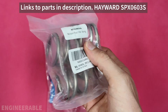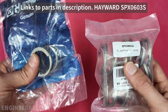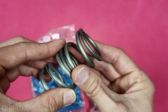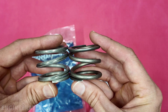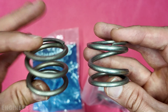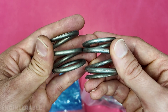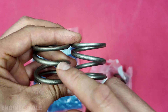That is crazy inexpensive. I don't know if the quality of these will last as long as the genuine product, but for $12 to $13 this is still cheap. The Hayward spring on the right and the Pentair spring on the left — you can see that the height is the same, the diameter is the same, the number of coils is the same, and it's just wound in the opposite direction. The wire diameter is the same too. The only unknown is what material the cheaper one uses and whether it will last as long as the genuine one.